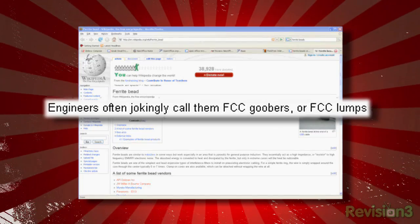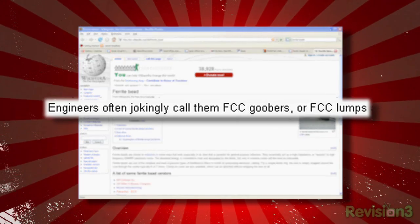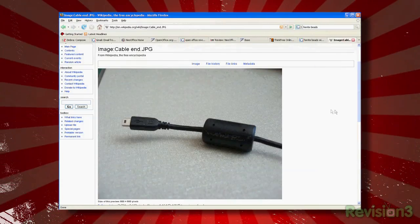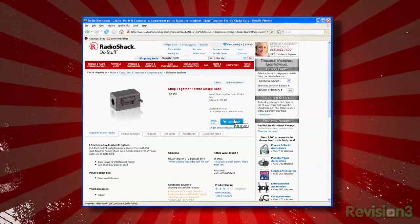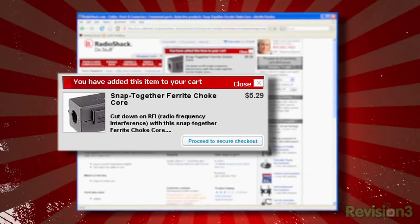You probably don't need them. I've moved around thousands of hours of video and I've never used a cable with a ferrite bead. There's one other reason why those are there: the FCC often mandates them so that the equipment can get its Class B certification. It's put there basically because they're afraid it's going to interfere with your microwave or something. You really don't need them — the high-frequency noise doesn't really matter. But if you're concerned, you can always pick up a pair from your local Radio Shack for five bucks and snap them on. Have fun with that.